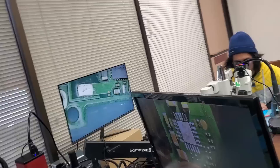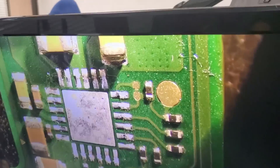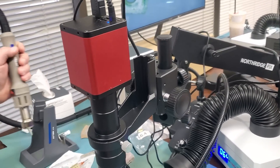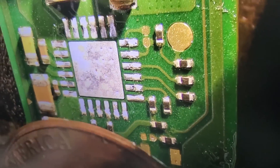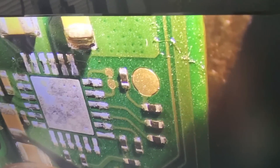It burns to that plastic connector? No, he actually took it out. So you took out that chip without affecting that plastic connector — using a smaller nozzle and 400 degrees at 70 airspeed? Okay, good. Now you're going to apply flux, apply solder, watch out for the neighboring components, and when you solder the chip you want to point air away from the plastic, which you currently have covered.